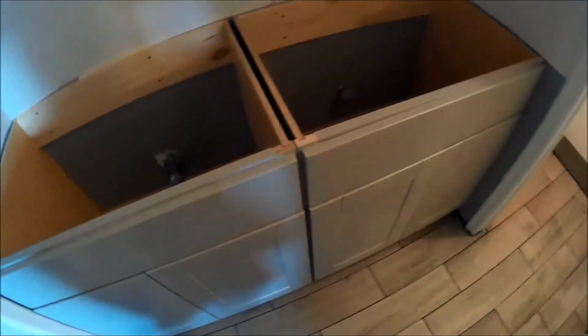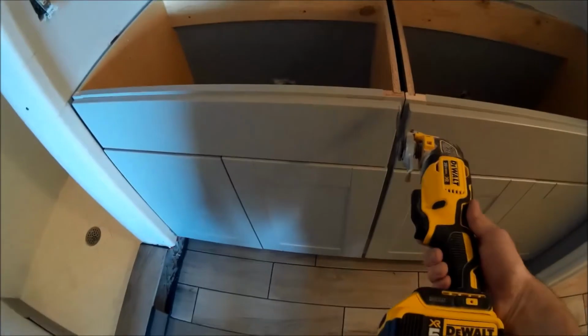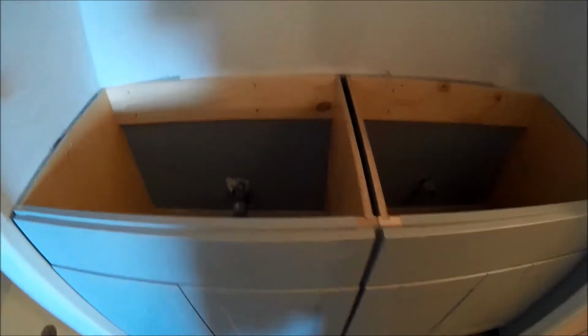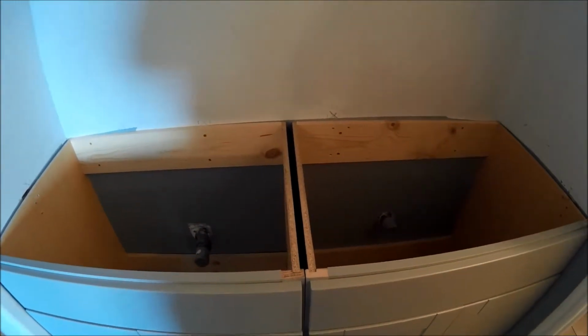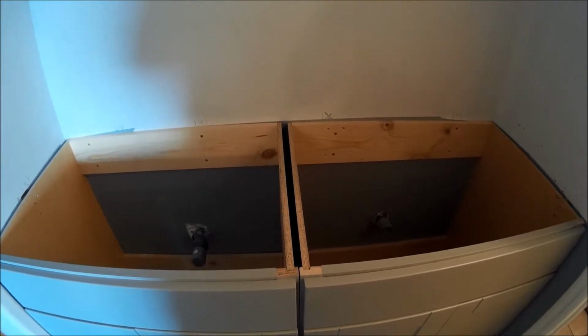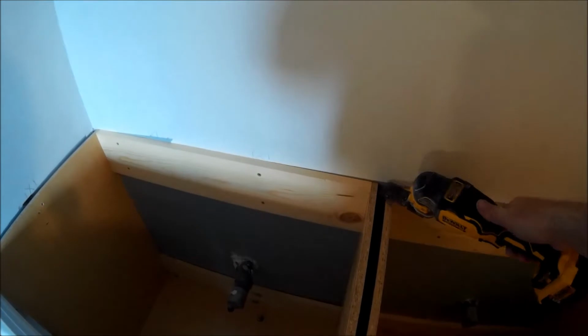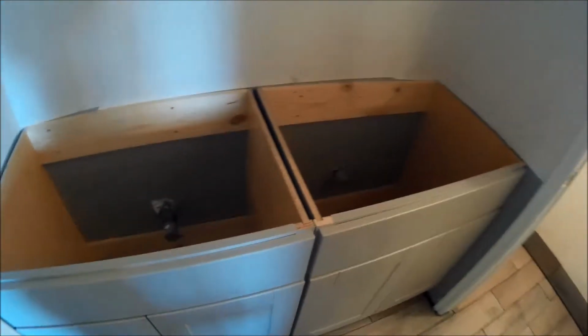These things are bolted to the wall, and they're bolted to each other, although that gap opened up a little bit more. Probably pulled from there, but I put 3 screws from this direction along this cabinet, and 2 screws from this direction along that cabinet. And it is good solid wood using deck screws. It should have held, but it did not. The other thought I had was to slip a piece of this board down in here and screw them together that way, but probably not necessary.